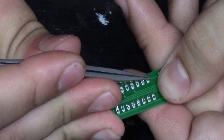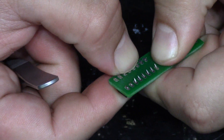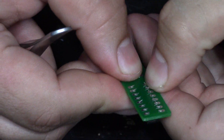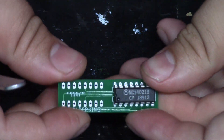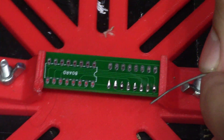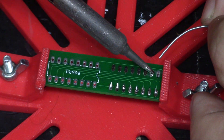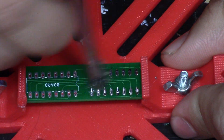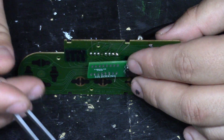As much as I really hate clinched leads, bending all the leads over allows for a flatter install. For this install I'm using 30 gauge wire instead of leads and it makes it much easier to install. After trying both, I highly recommend using wire over leads.